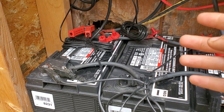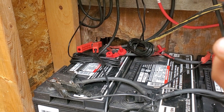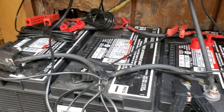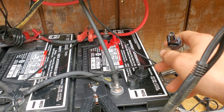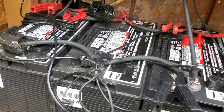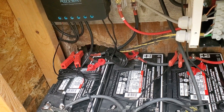However, since these batteries went down to basically 10 volts — which technically isn't a big deal for deep cycle batteries since you can drain them to dead and bring them back, that's the point — things have not been the same. They'll get up to like 70% and then immediately drop down to like 30%, they just instantly die. I bought one brand new battery as of last weekend but it hasn't remedied the issue. I probably need to buy a fourth one today. I can max this thing out with at least two more batteries. Lithium is better, I know the whole solar argument, but with the price of these AGM batteries, they're just right for me right now.